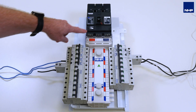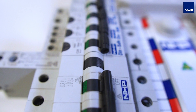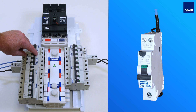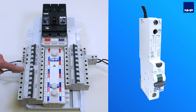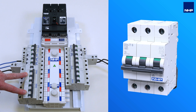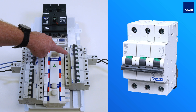Here we can see the concept isolator is feeding the chassis, and here we have some circuit protection devices such as a single pole miniature circuit breaker, a compact RCBO, a long body RCBO, a dummy module replacing a pole filler — as pole fillers can move, this is a more sturdy replacement — some three-pole MCBs providing sub-circuit protection, and another compact RCBO.